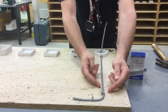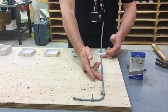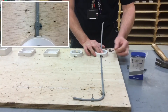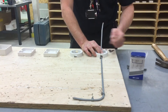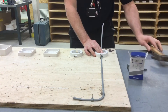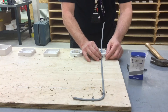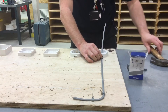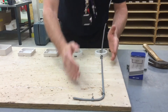Now I'm looking to come down straight into the accessory. Have I got to make any adjustments? Does it come down straight? Sometimes thrown off by the wooden board line, but I'm going to make sure it looks as straight as I possibly can. My last clip is going to go within about 15 to 20 millimetres of my accessory itself — not too close, because if I miss and hit the box there is a chance I'll break it. So we'll pin that one in place. If I'm happy with those I could leave them, or if I wasn't happy I could just take out the clip, wiggle it out with my fingers and adjust its position. At this stage I'm not hammering them into the wooden board because adjustments would be very difficult.